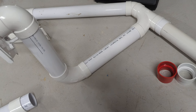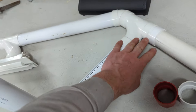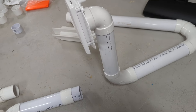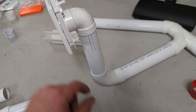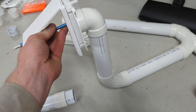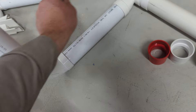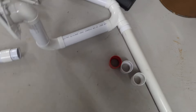After your raceway, you transition to standard fittings and it becomes a regular central vacuum — just point A to point B back to the power unit. But there's one big difference between a standard system and a retractable. In a standard central vacuum, the first elbow inside the wall is a short-radius 90-degree elbow — not only to fit in the 2x4 wall, but also so that anything long that gets sucked up won't pass that shortest turn, while anything that does pass through will continue through the longer turns. A retractable system is installed in the exact opposite way: long turns first to hold the hose, shorter turns down the line.